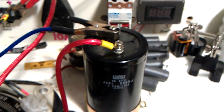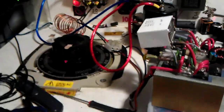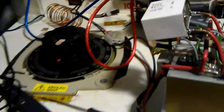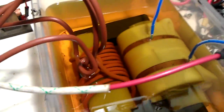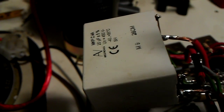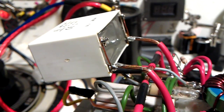I'm actually using one of these capacitors for filtering the 50Hz noise coming through the VARIAC when I'm using the DC side for the rectifiers. Going back to this video — this is a 50kV X-ray transformer through the old ferrite just there, and I'm putting it up to about 45 to 50 volts. I've changed the capacitor on there — that's a 20 microfarad. About 450 volts. And you can see it's got two outputs which are bridged over to be in parallel.